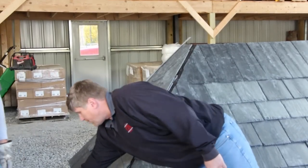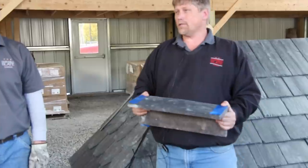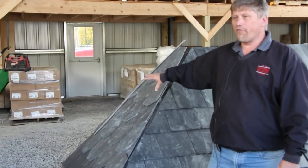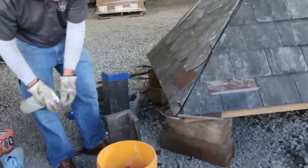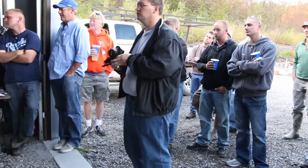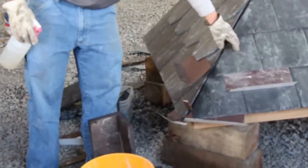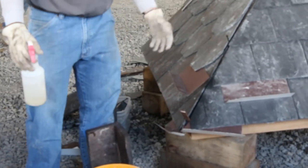It's what's called English V tile. It's natural clay tile that you typically would see in the historic part of Charleston, South Carolina, as well as the New Orleans area and throughout a lot of parts of Louisiana. The idea is it just gives a pronounced effect on the roof — you have a nice slate roof and then a big bulky ridge detail. Just spray down a little bit; you don't want it soaking wet, but you just want to make sure it's wet — maybe a little bit where you're going to leave the mortar. You don't want mortar bonding to the slate as it rolls down the roof, but basically, just like laying bricks, you need water to help bond the materials.